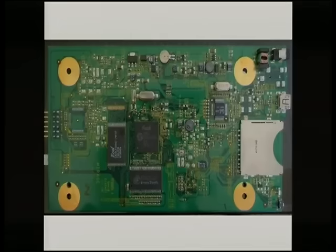What's inside it? The first thing we noticed on this very, very dark thing that we probably can't see, it's got three chips, and there's one in the middle. System on chip, this is your processor that's got your controllers for your RAM and flash. It's got USB and video and all that sort of stuff on it. First problem, which you'll almost definitely run into if you take apart a random thing, is you Google the chip number, and there are 100,000 results, and they're all to buy or sell it, and none of them are the interesting register definitions. There's no programming information for this. I searched for quite a while and couldn't find any.